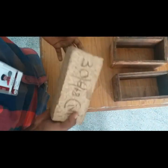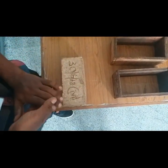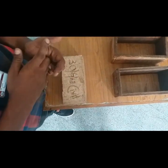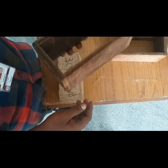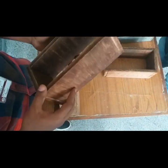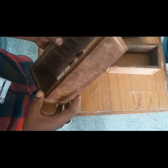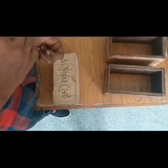This is the soil reinforcement brick we have prepared, which contains soil and cement in a 10 to 1 ratio, mixed with 20% of slag and 2% of scrap by adding water. The mixture is filled into the mold, which is lubricated on the inner dimensions and has the standard dimension of about 19 × 9 × 9 cm. After filling, the mixture is finally compacted to avoid voids.